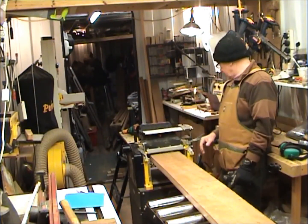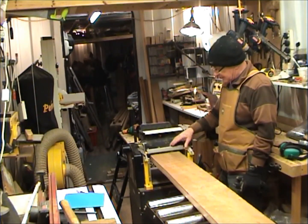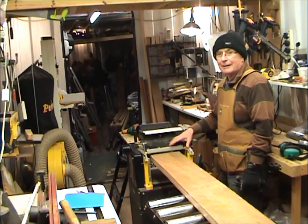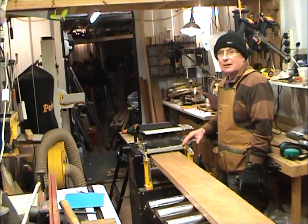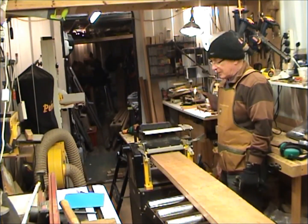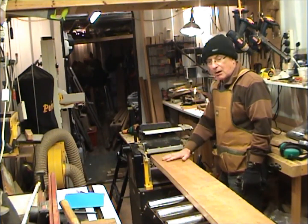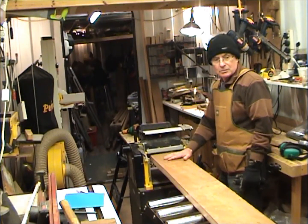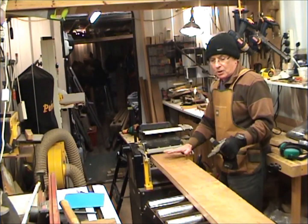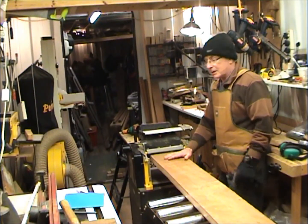And the machine I've got here, I've had about 10 years, and I bought it from Axminster Tools, and it's a 2.2 kilowatt machine, and that's about the minimum motor size you need. Once you go smaller, they wouldn't have the power. This does struggle with this wood, but being Iroko, it does blunt the tools. You will have seen when I was cutting the length, it was quite a job for the saw I had, and that's got a new blade in it.